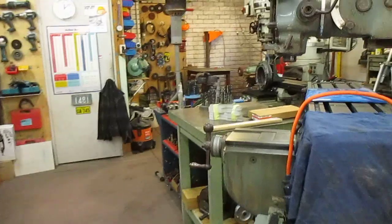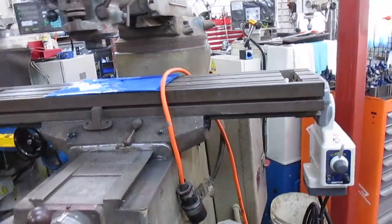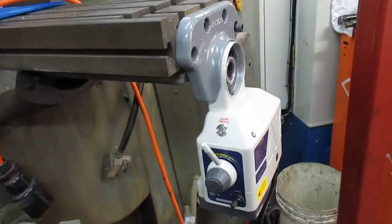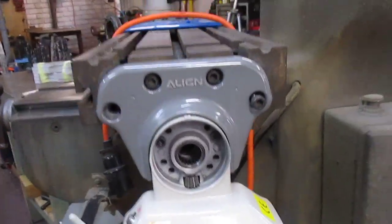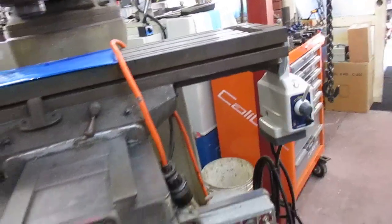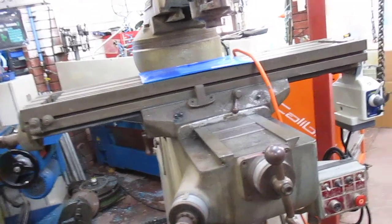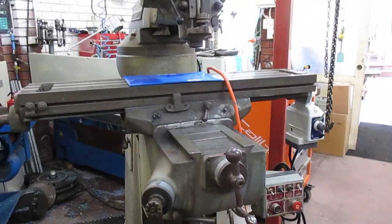The other job I've started on also is this Bridgeport, which I've sold. I'm going over it now — mounting it on an X-drive and I've begun to set that up. I've got to make the shafting and so forth to suit that, to pick up the DX shaft. I've taken the motor off and that's gone off for checking with electrical. We're going to run this on single phase — it was a three-phase motor — and I'm going to put an inverter on this machine so it'll have variable speed at the touch of a button. So there we are — this is Bruce's workshop, Saturday almost lunchtime. I might go have a tub and take my wife for a Saturday drive.